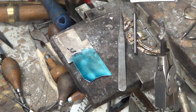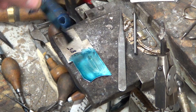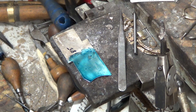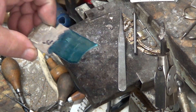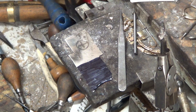The next thing we're going to do, after we've got our metal all cleaned off and ready to work with, is put what I call Dykem blue. It's just a machinist stain that you put on your metal so you can trace lines and see where things are. We're going to do cutting with a jeweler's saw, so we need to trace our lines and be able to see them. By using Dykem blue it makes those lines show up a lot easier. Once it dries, it's easy to draw a scratch line on it. Now I've also got another way to do it so you don't have to go out and buy Dykem blue.